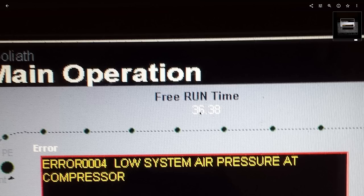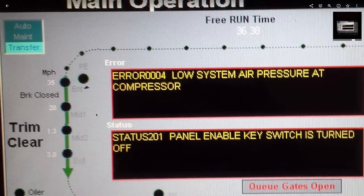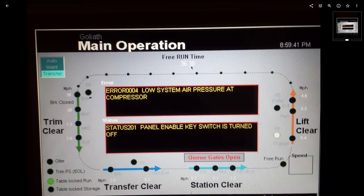The colder it is, the slower it runs — I've seen times as slow as 38 seconds, and about 30 seconds when it's hauling on a hot day. But you don't want it too hot, because then it enters the brake run going too fast and that causes a trouble light. When we had hot summer days it would keep trouble lighting for overspeeding into the trim brake, and their solution was just to take a car out of service to reduce the weight.